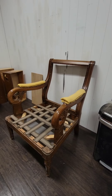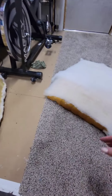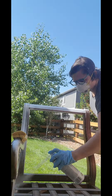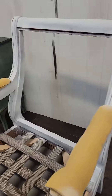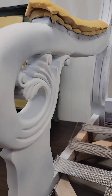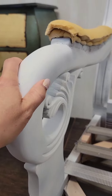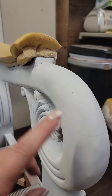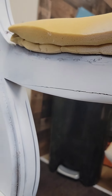Here's where I landed on day two. Here is our nude chair. I'm going to get rid of this, but this foam is still in good shape. I took the chair outside so I could spray primer over those details that are too difficult to brush, and now I won't have to worry about my paint not sticking. I used about three quarters of a can. I'm not concerned about bleed through as much as I was concerned about the fact that this was slick and glossy and paint wouldn't stick to it. This is not a crack in the wood — it's a crack in that thick coating of shellac that was on there. Now that's a little bit of a crack that I want to fill.